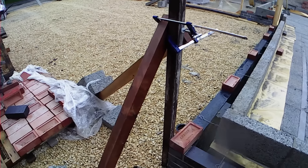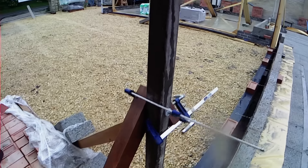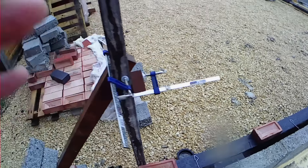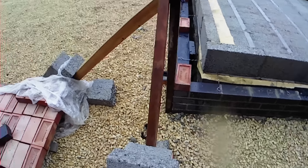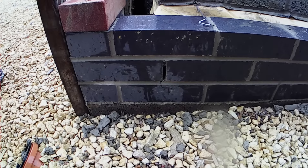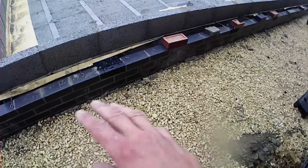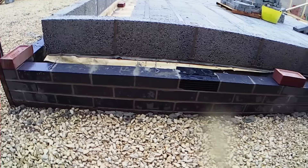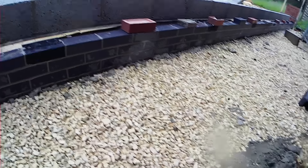I also haven't got enough blakies, so I have to do it the old school way. Just prop one side going that way and the other — job's a goody, good old F-clamps. I have raked the old out. I haven't brick-acid'd the blues yet — I'll wait until I've built the brickwork up first and then go again.